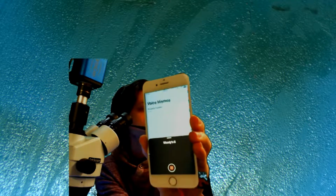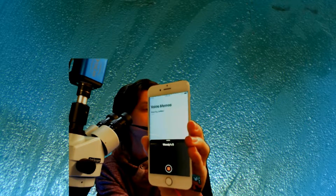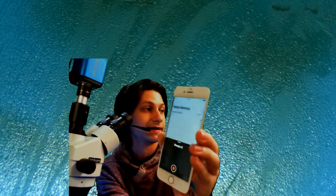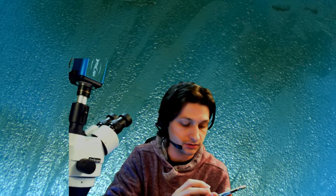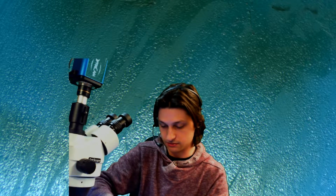So when you hit record, there's no microphone. Most of the time for these, the red recording bar is grayed out, so you can't record at all. With this one, it is just no microphone at all. And with the calls, you couldn't hear on the ear speaker. It was having multiple audio issues, so that just screams audio IC for the iPhone 7.